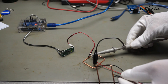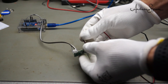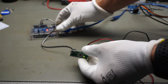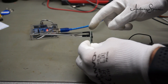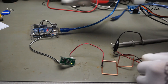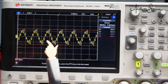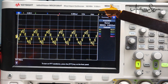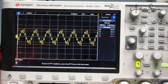If you attach the probe directly to the device, it would stop working. I connected the RDM6300 via software serial to an Arduino Uno. We only need the TX pin because we just read the code. As always, you find the link to the software in the description. As soon as I approach the measuring loop near the reader coil, we see a continuous signal — an ugly sine wave with some harmonics.